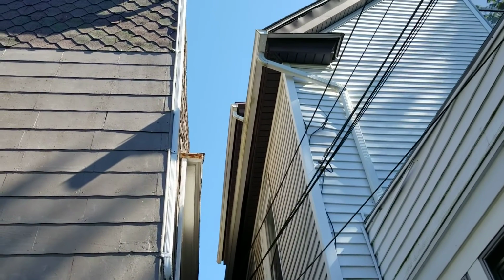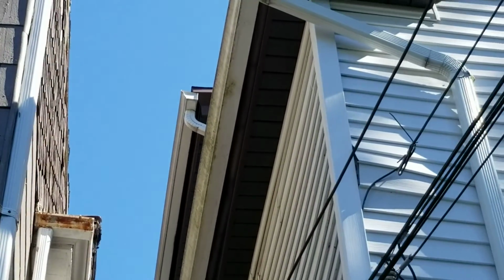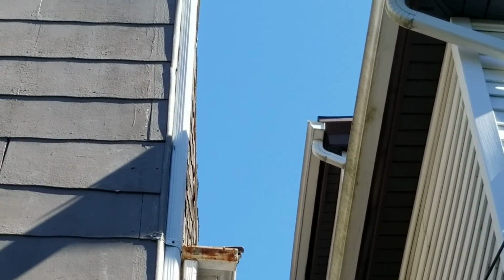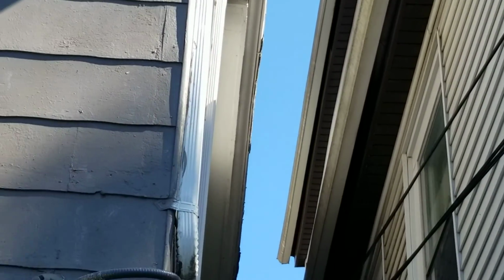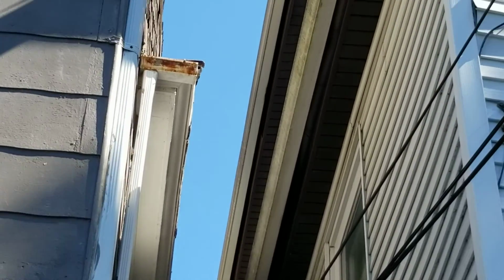If you look at the brown trim, right where the first bend of the brown trim is, that is recessed almost 3 inches from the face of the gutter, or from the face of the drip edge. So once we lower that, if we were going to do a fascia mount, that would pull that gutter in to where it would be completely hidden by the roof. So to lower that the inch and a half, it's not doable. So that fascia would have to be rebuilt on top of it to accept our gutter. The lower we could strap hang and gutter it.